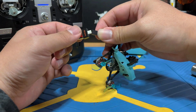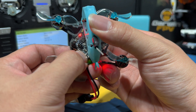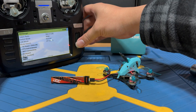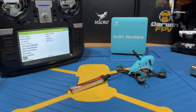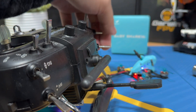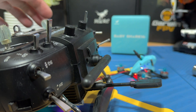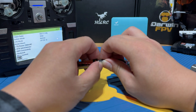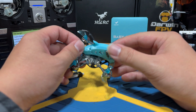Now plug in the battery. Once the battery is plugged in, you can see on the Drag Shark's board there is a tiny bind button — just hit it. After pressing bind on both the drone and radio, they should be bound together. With default radio settings, the arm switch should already be working — you can flip it and see the motors spinning. If you just want to go fly, you can stop here. But if you want to know the proper ways, including the second method and the binding phrase method, let's continue.